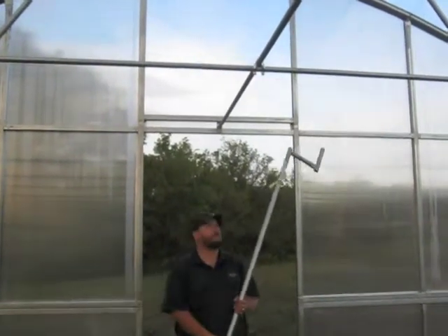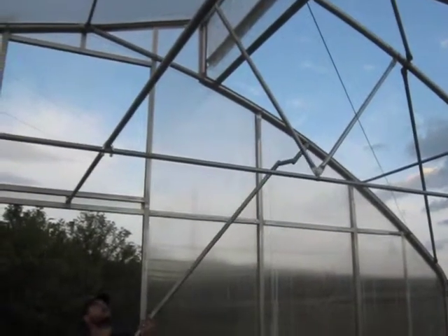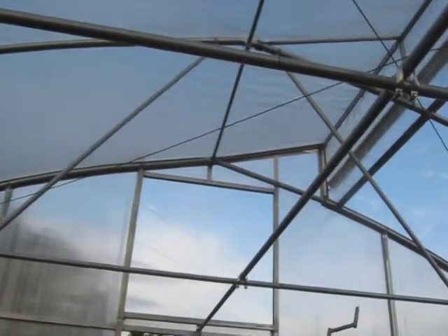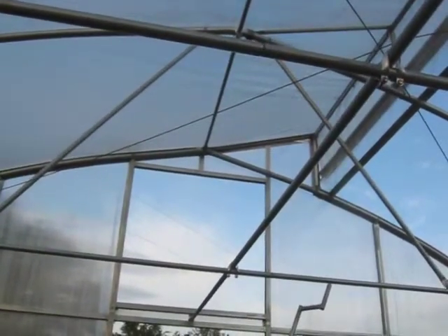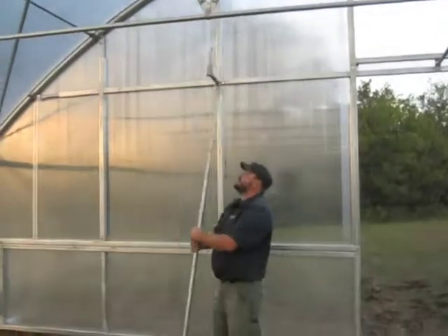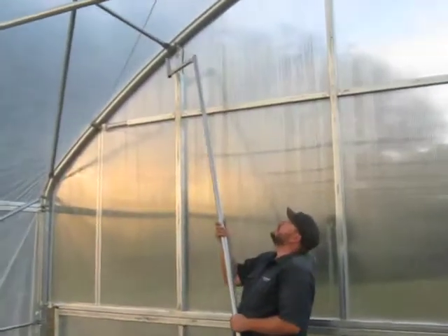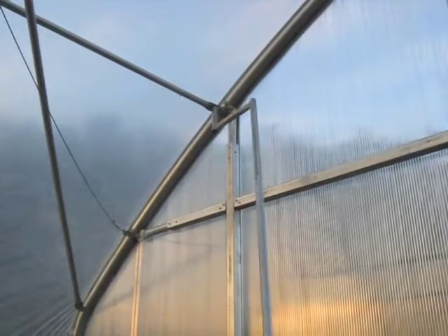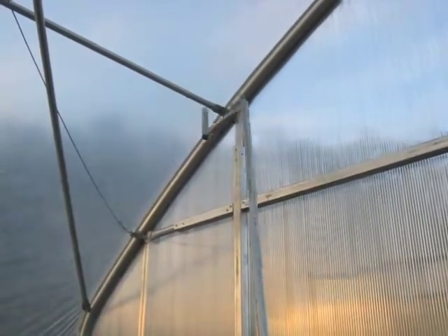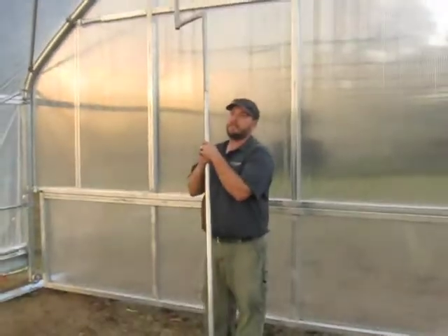To make up the actual W of the truss, we've got a short truss and a long truss — half forms a V on this side, another V on that side, forming a W. The purlins attach to the structure at the end walls using two brace bands onto a purlin end. This one-foot purlin end is flattened on one side, allowing us to bolt it to the end wall for a much stronger connection, secured with a self-tapping screw. At the far end of the structure, we cut the purlin to fit where we want it.